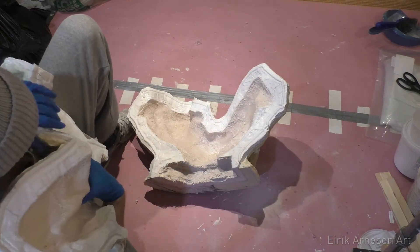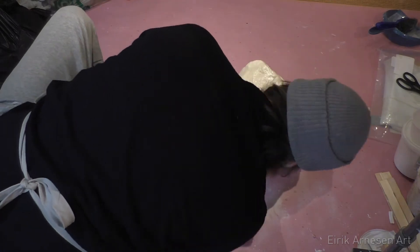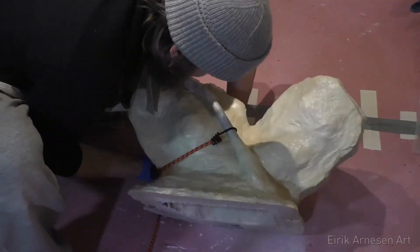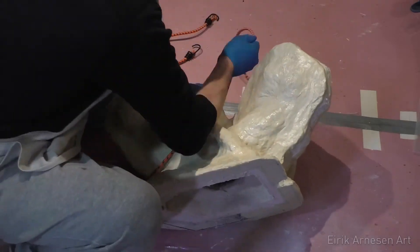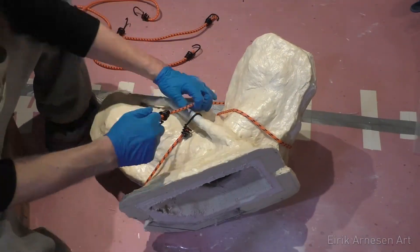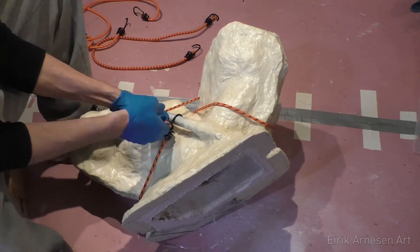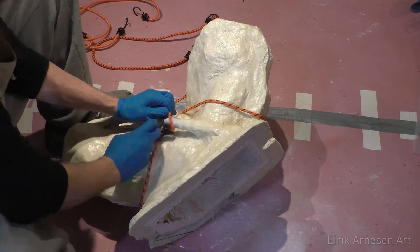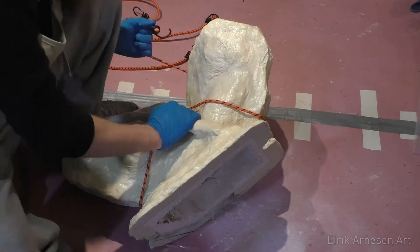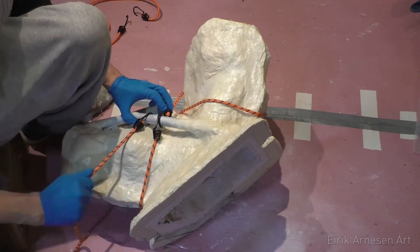This step is crucial and I test fitted the mold together a few times to make sure it went together well. When it didn't, I tried to locate where the fiberglass was interfering and went back and cleaned it up with the knife. A good trick to see if your mold is properly seated is to take a flashlight and shine it down the seam from the outside of the mold while you look into the mold. If you see light shining through, something is interfering with the seam and you can locate it and fix it.